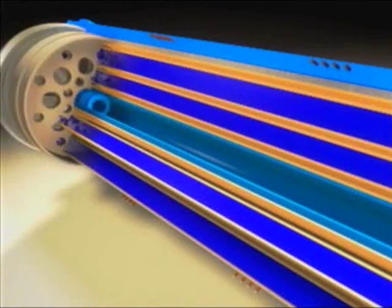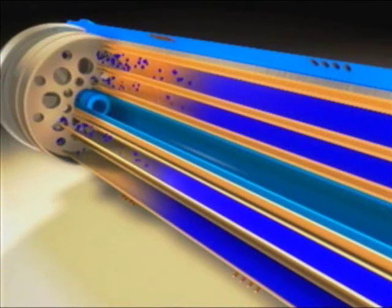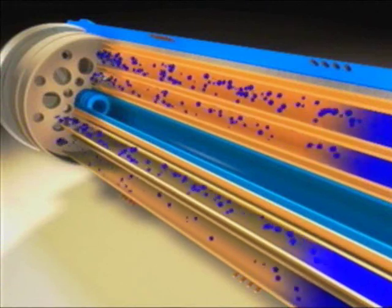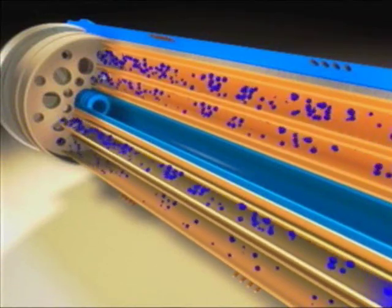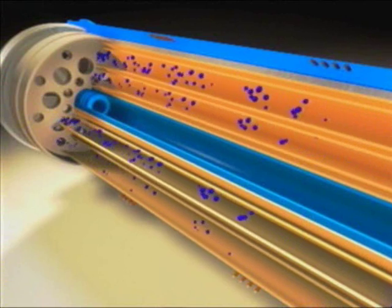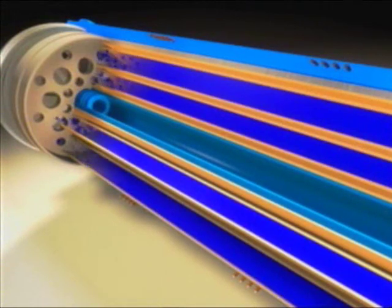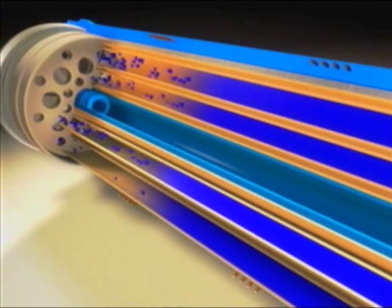The unique concept of a collapsible spacer in the micro and ultrafiltration plus applications allows particles between 1 to 3 millimeters in size to flow unobstructed through the feed channel. The spacer is flushed out during initial startup protocols.